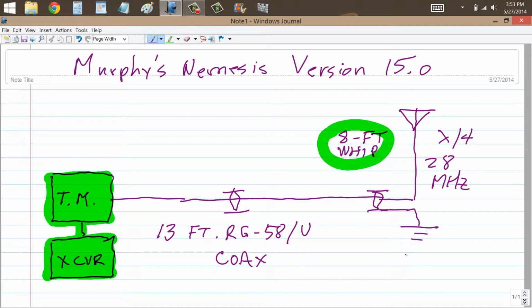But I can force feed this antenna on other bands, including 6 meters, then the 12, 15, 17, 20, 40, and even 80 meter bands. I can get this thing to take power. I would expect it to be a pretty rotten antenna on 40 and 80 meters. 30 meters too, by the way. But I have used it on 20 meters, that's 14 megahertz and up, with amazingly good results.